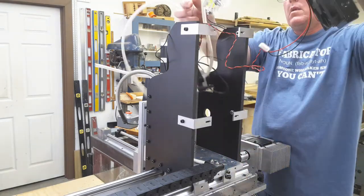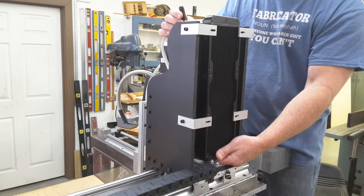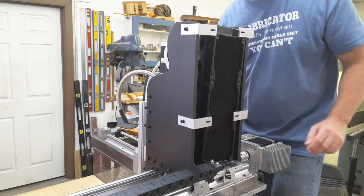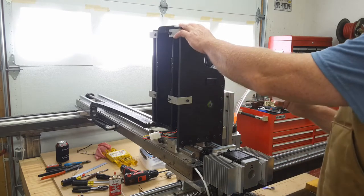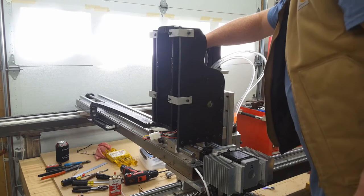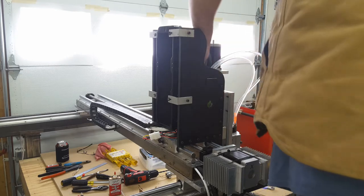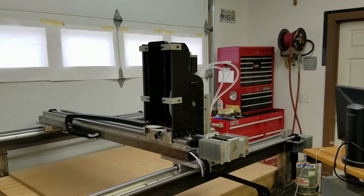Here's the new pump and reservoir setup — a little smaller, configured a little differently. I think we're back in business. I added a T-connector up here with a cap on it — this is where I'll vent air or inject water to start filling it. I want to make this run and see how it does before getting carried away tidying up. I've put some water in it and gave it a little test run. With the cap off the reservoir I can run it — it's pushing the bubbles out into the reservoir, and all I have to do is keep the reservoir full.